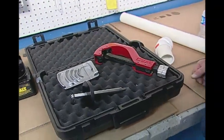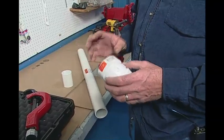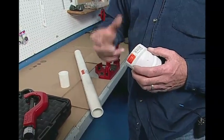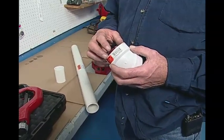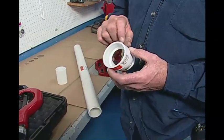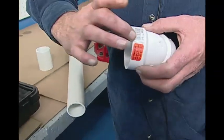Those are the three pieces to the 636 kit. When you're doing any kind of plastics fitting — whether it's PVC, ABS, CPVC — the two things that matter when you're putting pipe together is that you have a square cut so that you can get full stab depth into the fitting properly. And also that you put an appropriate chamfer or angle on the outside edge of the pipe so that as you stab it in you're not squeegeeing or plowing the solvent cement off. These plastic fittings have a relatively shallow collar — not even a full inch on this 2-inch 45. And not only are they shallow, they're also tapered — they get tighter and tighter as you go inside that fitting.